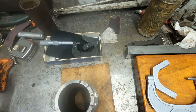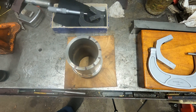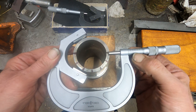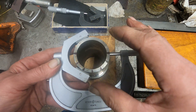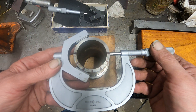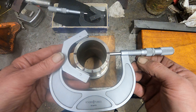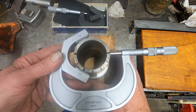Here's that piece, and I've got this camera boom thing here — it's going to be hard to see this. I've got this piece of metal here with index marks on it, and I'm going to check it right here. I hope you can see the scale on the micrometer. This is a V-anvil micrometer and it automatically centers, so it makes checking things like this quite a bit easier. It's a bit like having the work on a V-block on a surface plate. This is reading 2.511 — 2.5 and 11 thousandths, right on the mark.